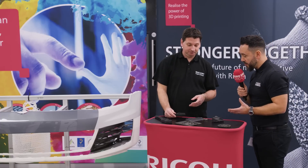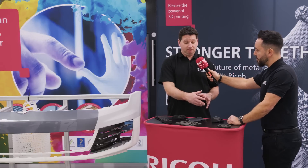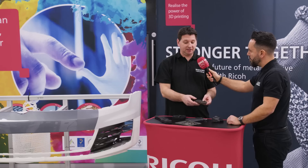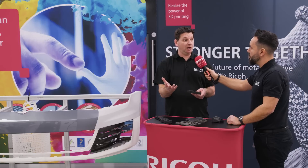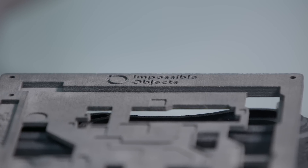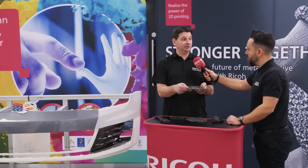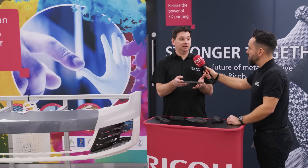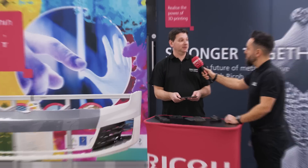You have got some examples in front of us here — could you talk us through some of them? Some parts we've printed with this technology can be gears like this one for industrial applications, printed bike pedals for the sporting industry, or anything that requires performance and lightweight. Another application we see a lot of interest for is printing jigs and fixtures for the electronics industry, solder pallets where again you need that high temperature resistance and dimensional stability in a very critical environment.